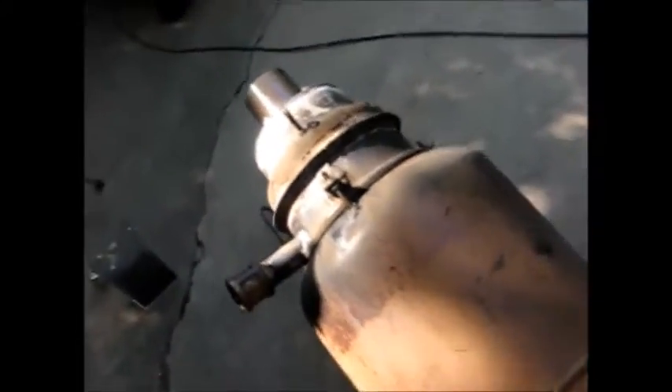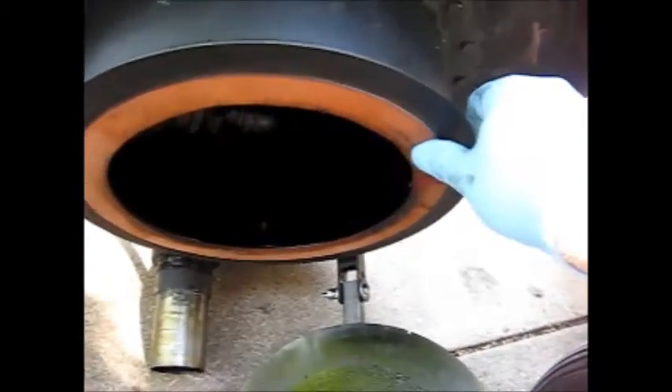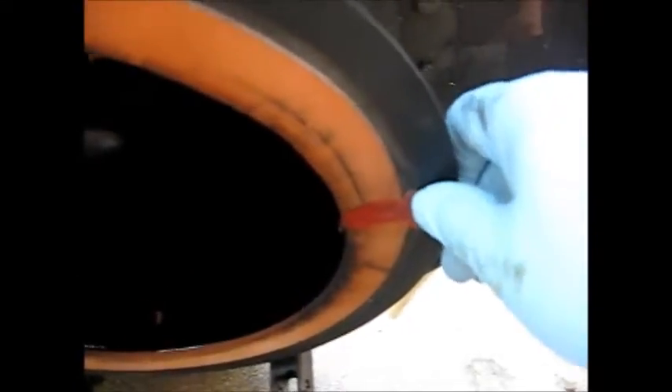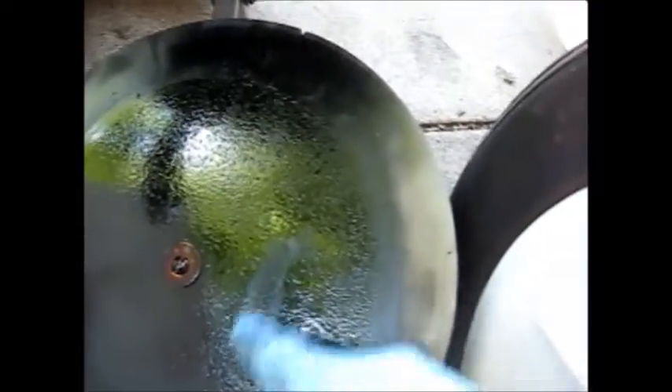As you can see on the lid for the wood hopper, I have a good seal on here. It's made of 2,200-degree soft foam seal, and I used a bit of high-temperature RTV to seal that — I feel pretty good about that seal. One thing I need to do is put a pressure hasp on it that pulls it down tight. You can see the tar on here; it's actually coated like a ceramic material, all shiny. That's the tar and it's burned on — it's not sticky at all.